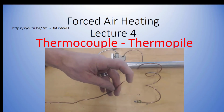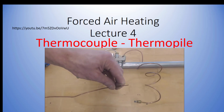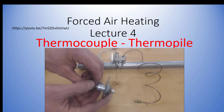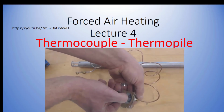Here's an example right here. You have the inner wire and the outer wire. And then at the end, you have two dissimilar metals that are welded together in order to connect them. So anytime that you heat this rod up, you're sending DC millivolts over to here, and we're going to go ahead and see how this DC millivolt solenoid works. So we're going to connect this in, and then I'm going to go ahead and heat this up.